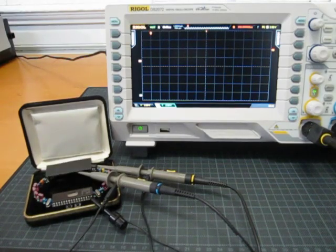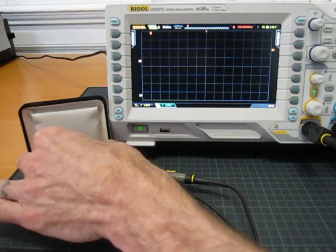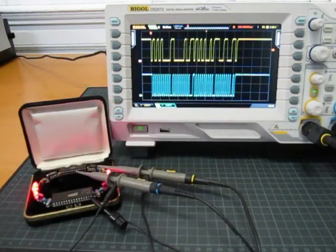So anyway, we're going to test the I2C trigger. I've got a little artwork of mine called the jewelry box hooked up to the scope, and it uses I2C to communicate with a clock chip and an EEPROM. So let's see how that works on the scope. I've got a little piece of cardboard covering the LDR. Remove that.